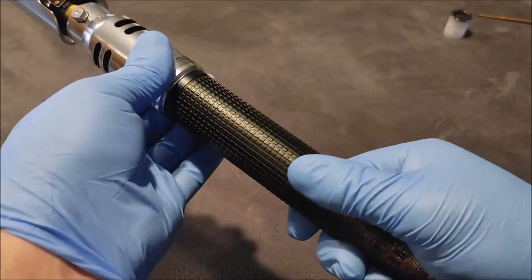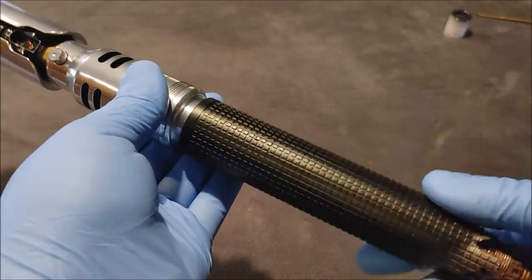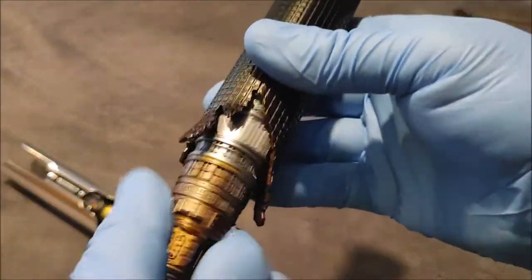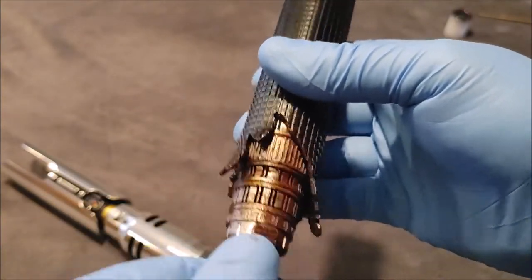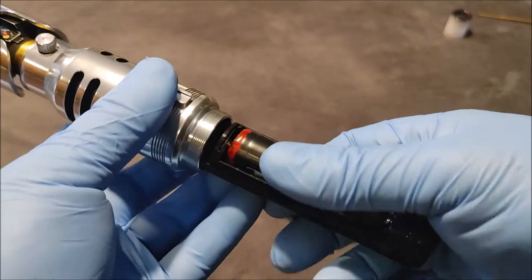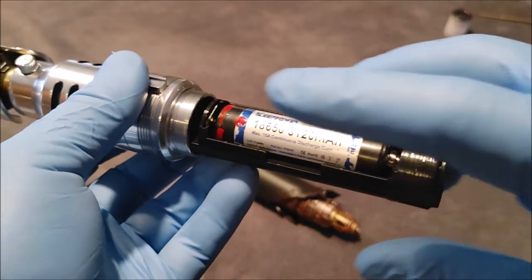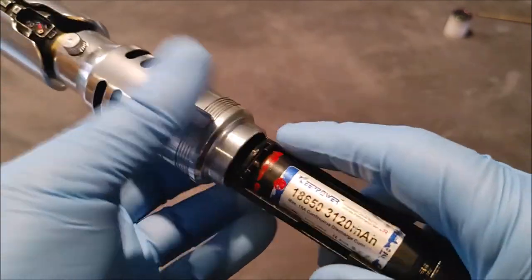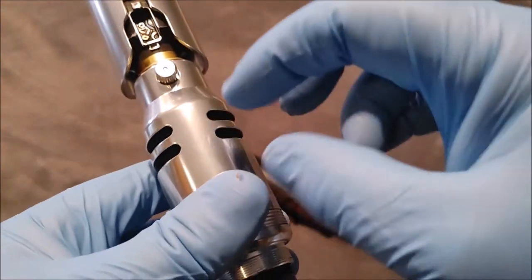The Verso board is housed inside the chassis. We'll take this off and unscrew the handle — it's a very solid build. The handle comes off; there's your battery right there. The pommel also unscrews but once you have it all the way tight, that's where you want it. We're running the KeepPower battery 18650. I put red marks on here so you don't put the battery in backwards — positive is always forward, the spring is obviously the negative. The chassis is housed all the way in to where it gets to the switch part — that's how the Verso sits in here.